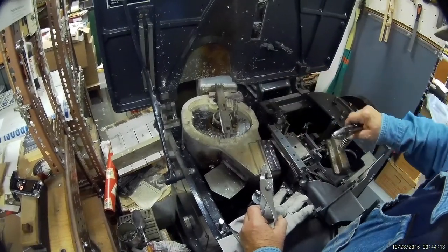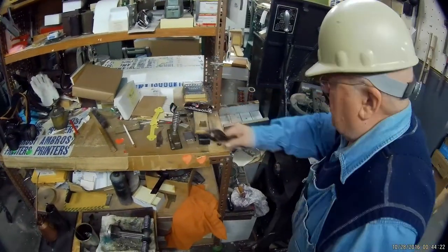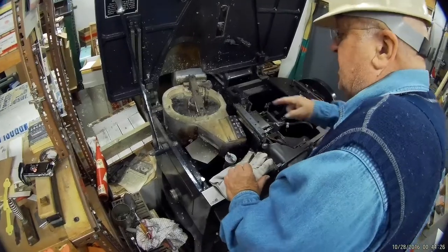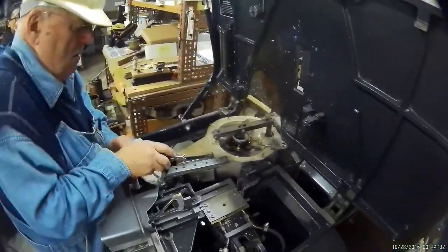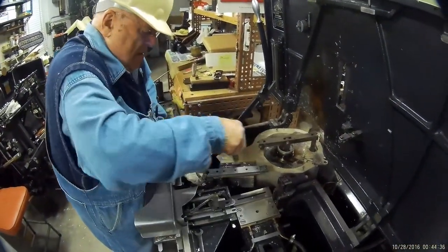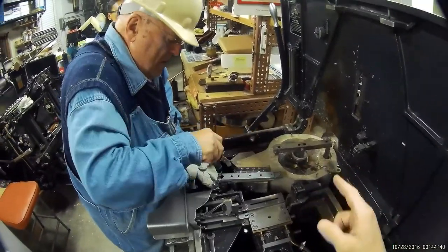Is it okay to uncover the mouthpiece now? Yes, because it can't go up and down by itself. So that's important — you don't remove the anvil, or the mouthpiece cover, until the plunger assembly is reassembled. That's right.